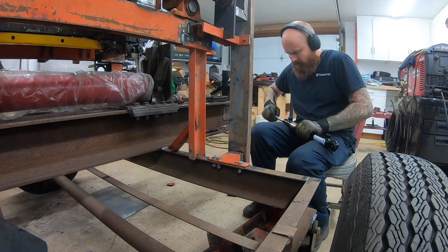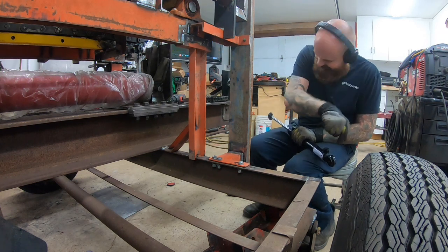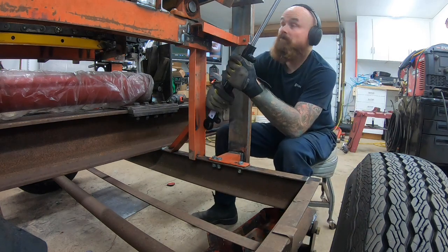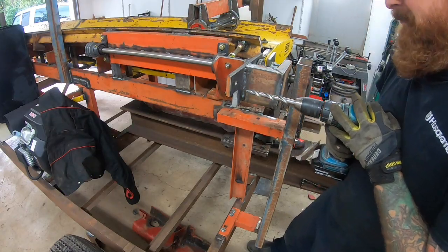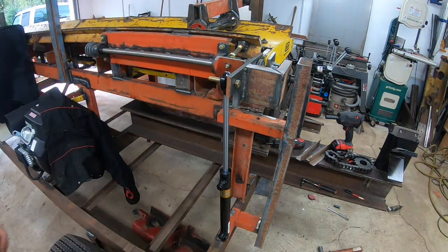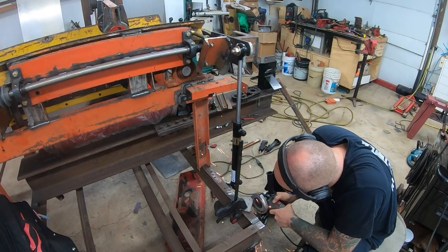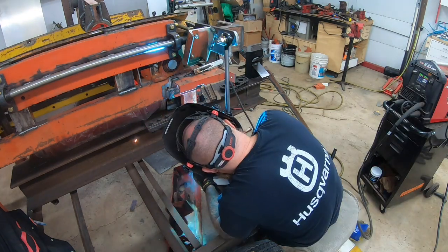I had to order my saw cylinder — safety glasses, luckily that didn't get in my eye. I had ordered the saw cylinder when I ordered my valves because I knew exactly how long I needed it to be. I got a one-inch cylinder, pretty much the smallest I could find through Surplus Center. It's a 0.625 rod, and by turning my pressure down it should work out for the saw without it being uncontrollable or putting too much pressure down. We'll see.